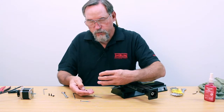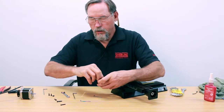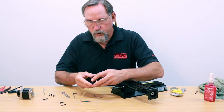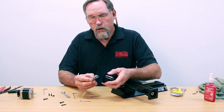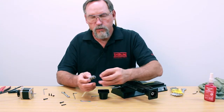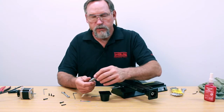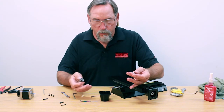Take out the two 8-32 screws and the 5-40 screw from inside the coupler. Once you've got that taken apart, the coupler should come right out. The coupler comes out with the inside bearing still on it and the back bearing as well. So you have two shoulder bearings — one on the coupler on the inside — sandwiched between the wall of your motor mount. If you were going to replace the bearings or replace the coupler, you would take it apart to this extent.